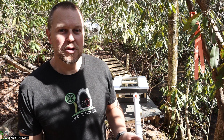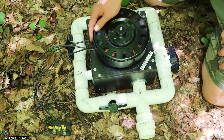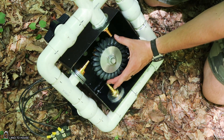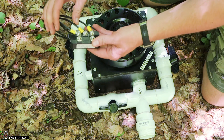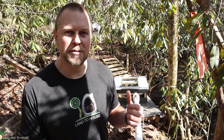I'm here in western North Carolina to take a look at this unit right here. This is basically a motor connected to a Pelton wheel — a bunch of spoons or cups lined up that a jet of water pushes around quickly to make three-phase AC. That three-phase AC goes into a rectifier, sent up to a charge controller and batteries and an inverter to be used in the house. Let's take a look at this system so you can see what a PMA looks like.